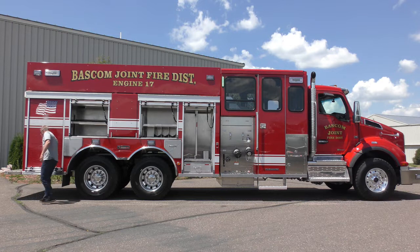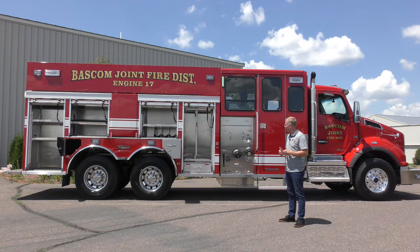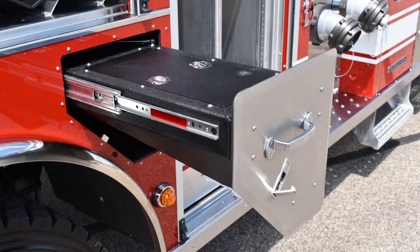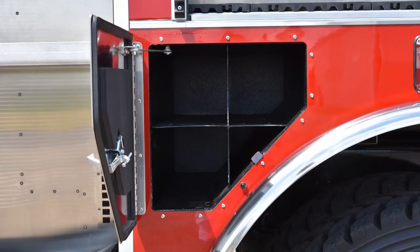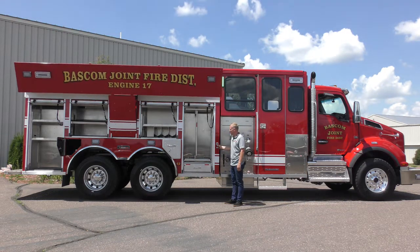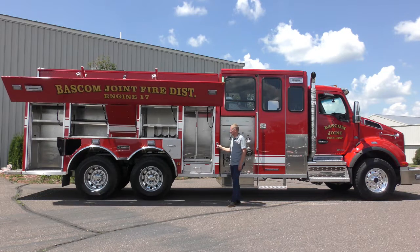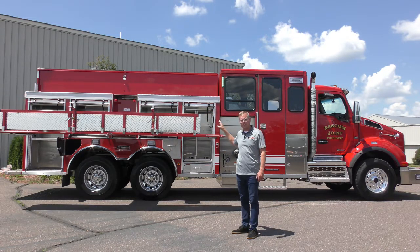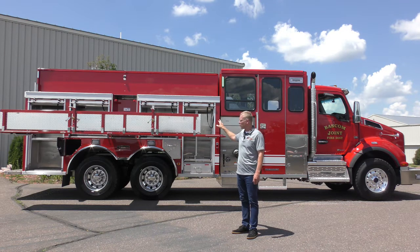On the officer side of the truck, we have a bit more going on in the compartments — that's pretty common since this is usually where most of the rescue equipment is carried. In the front officer side compartment, we have a large pullout drawer under a false floor and then a pullout tool board, where cordless hydraulic rescue tools will be going. Over the rear wheels, we have a pullout oil dry container, storage for three air bottles, and an extinguisher rack ahead of the forward duals, plus our center arm ladder rack. Behind the rear wheels we have some adjustable shelving. The ladder rack is concealed with a parade panel where we've mounted additional scene lighting and their insignias. The ladder rack will carry their extension, roof, and attic ladders, and there's also a large diamond plate box which will carry additional hard suction hose.